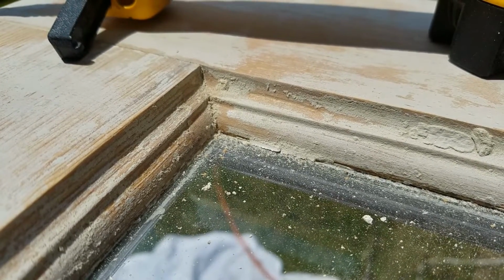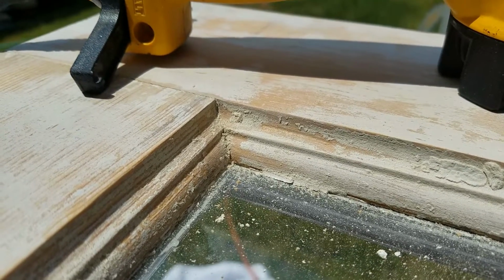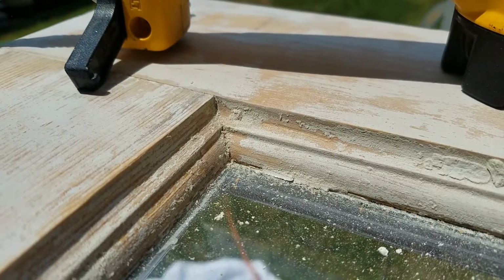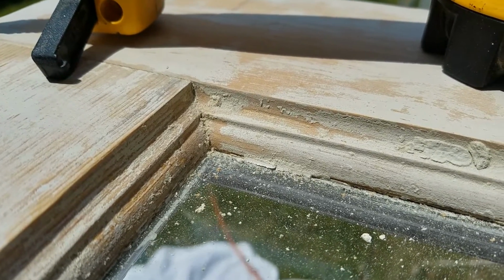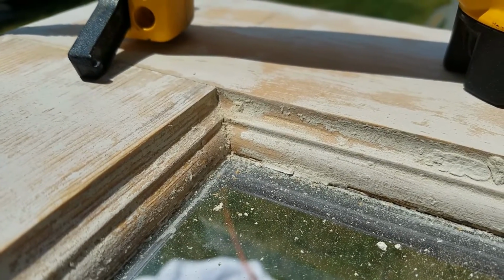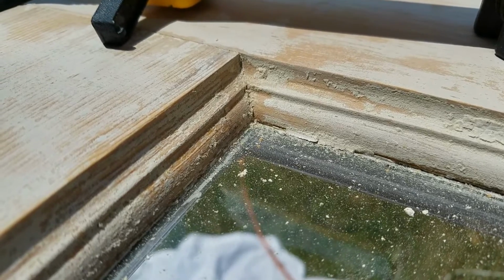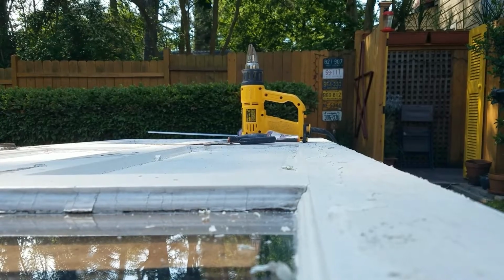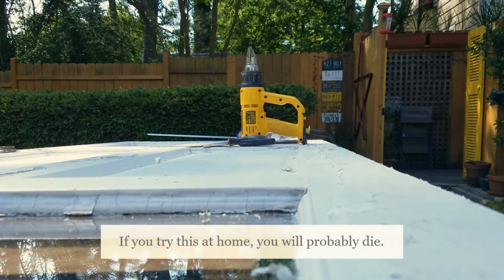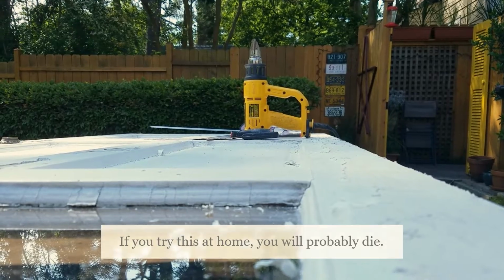You remember the old modeling clay? It used to be really stiff. But if you were to think about pushing your putty knife through that type of clay, that's about the resistance you want. That's how you know you've gotten the paint nice and soft. But you can get those corners cleaned out very, very well. This has not been sanded yet. That's just what it looks like. And in case it isn't painfully obvious, please wear the appropriate safety gear when dealing with lead paint and with fumes. Thank you.